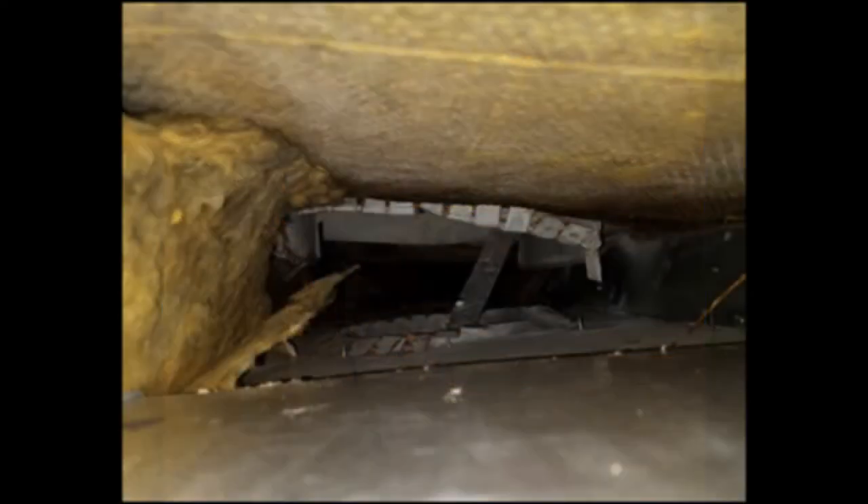I'm going to show you four photographs that I took with my camera of various types of ductwork and various conditions. The first two, metal and duct board, are clean and unobstructed — this is what we want to see. The third and fourth pictures show holes and collapsing of the ductwork. This does not allow the air to move freely and as a result, you're losing energy and it's causing comfort issues in the home as well.